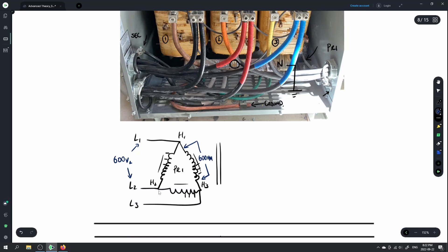We're not responsible for creating this delta — that's already done for us. We're just responsible for bringing the appropriate size conductor in and tying it into H1, H2, and H3. On the secondary side, as shown in previous videos, we normally just have one winding per phase.